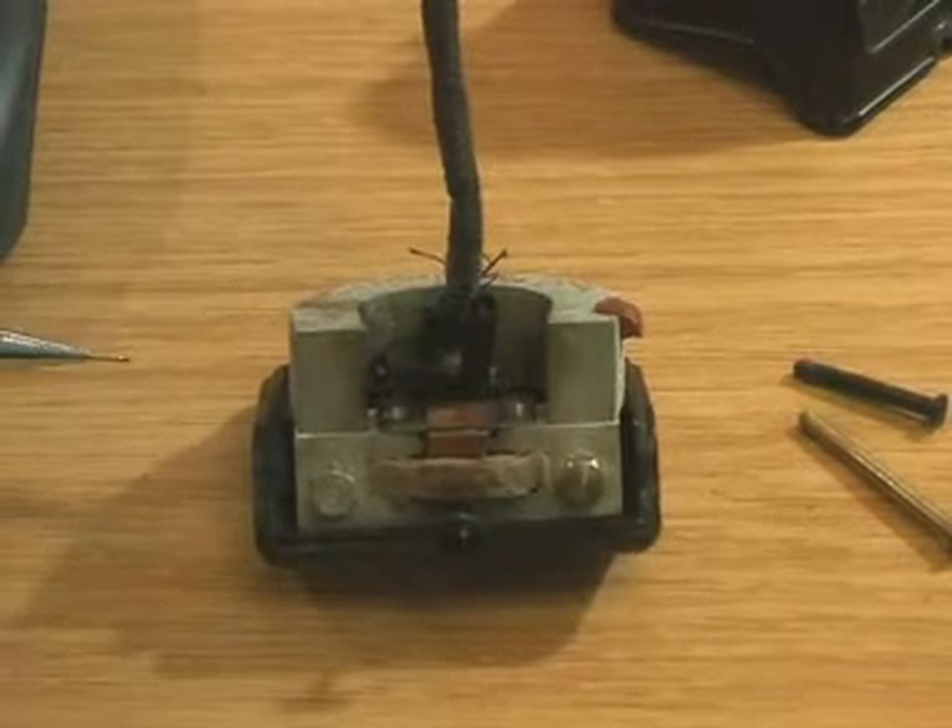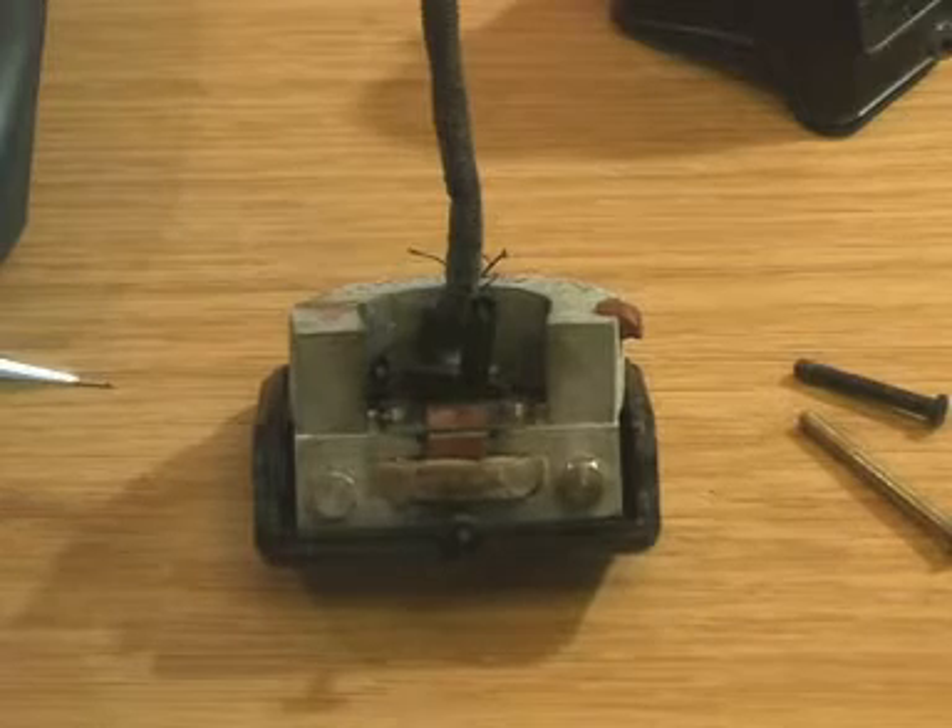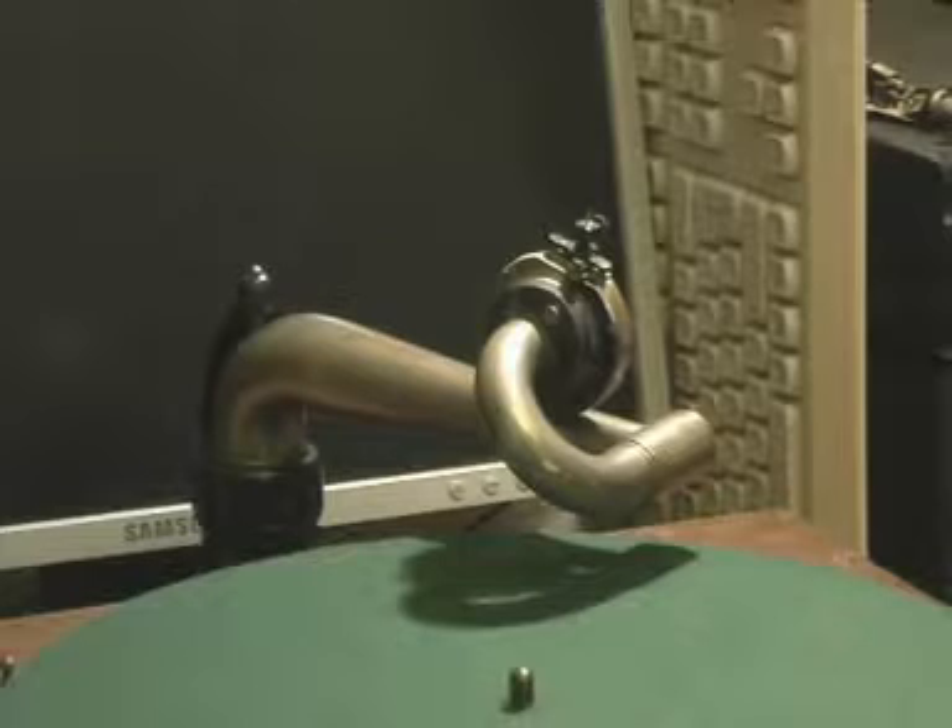Something excellent has just happened. We had two of these pickups but neither of them worked. But then a nice chap saw my web page on these type of pickups and wrote to me saying he had a couple I could have for next to nothing. One of them was a number 11, and to my intense delight when it arrived it still works. The coil of wire inside is extremely fine with many thousands of turns — they corrode at the ends and become open circuit, but this one still works.